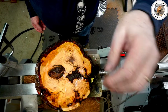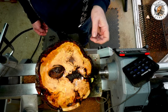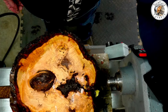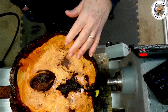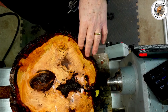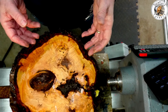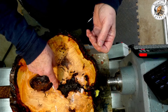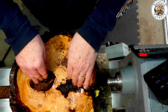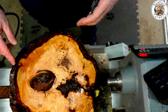Here it is after I've applied three or four bottles of super glue, and also filled it with some copper dust, some ebony shavings and some coffee grounds. I wanted to try and leave quite a lot of the voids visible but also wanted the bottom to be glued up so that it was solid, because this here was getting very close to that there — I didn't want the whole lot to crack at some point. So it's soaked in super glue on the bark at the moment.